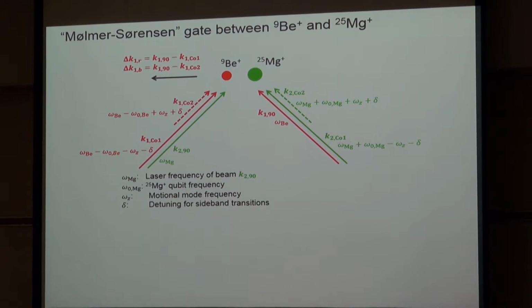So there's a tune-up process there, but again, we get all the advantages that I described before that were laid out by Chris and company. We're just doubling up now, and we just need to synchronize one RF phase to get the forces in the same direction in the XY plane in these schemes.